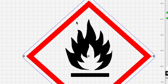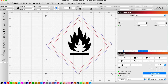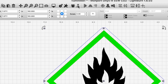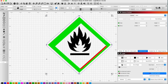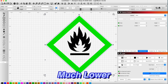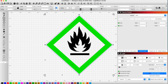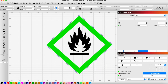The first thing I'm going to do is group these shapes, duplicate this with Command D, and then put it on another layer. Then I'm going to ungroup and make the inner shape a little bit smaller, and grab the outer shape and make that a little bit bigger. What this does is allow me to run this at a much lower setting, but also ensure that I'm going to get all of the powder coat when I run a second pass on top of our engraving — we'll be sure it fully melts the powder coat in the red area.